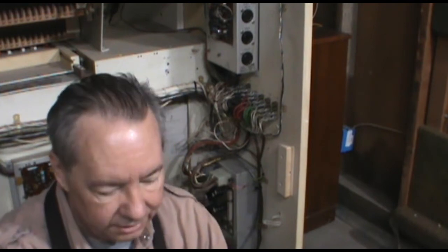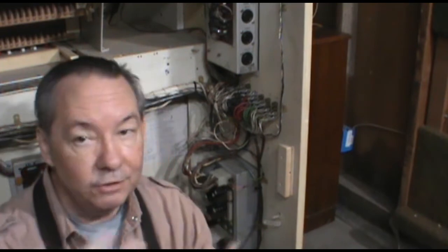Electricity is actually the differential in potential. So if my feet are at a million volts and I grab a wire that's at a million volts, the same polarity, say a million volts plus on my feet and a million volts plus in my hand, there's no difference of potential. So there is no electricity. Nothing is happening. And so when a bird lands on a high voltage wire, there's nothing happening because there's no difference between the wire and the air.